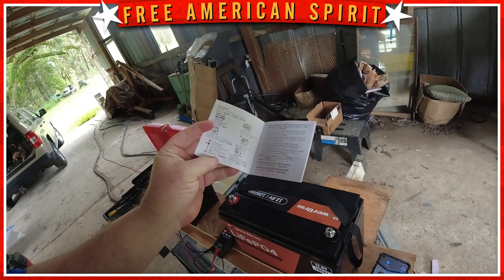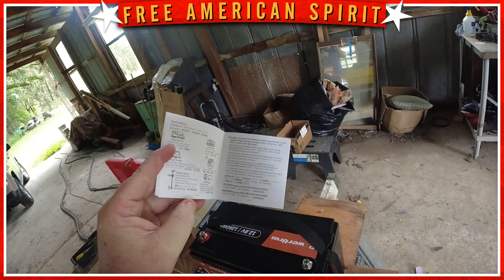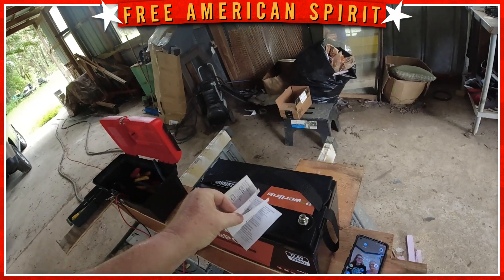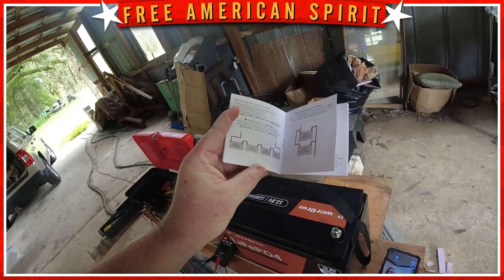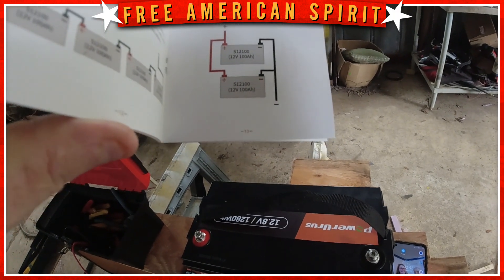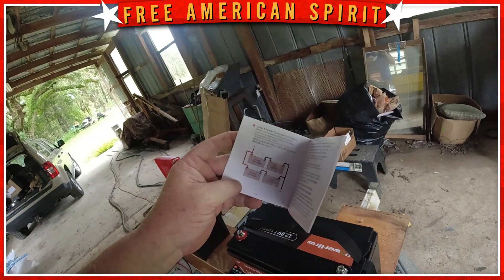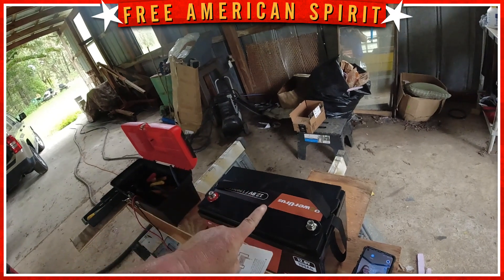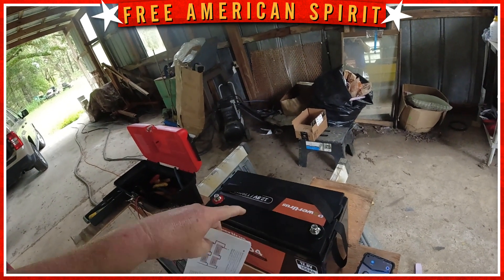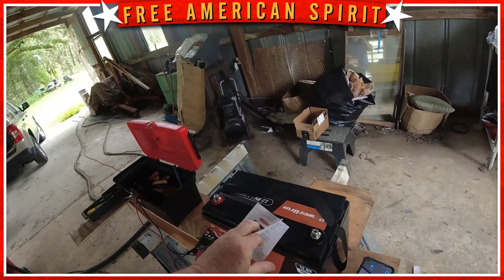Other items in the manual: for trolling motor use it shows all the things you can use this battery for. They suggest charging the battery to 12.8 to 13.24 volts to avoid over-discharge when storing. Then you've got the wiring diagram for putting them in series — you can go up to four batteries in series for 48 volts, or put them in parallel. By the way, on a boat you never want to ground to the boat itself, at least on an aluminum boat. You can also do series and parallel combinations: four 12 volt batteries in parallel, two sets of series parallel for 24 volts, three batteries for 36 volts, or four batteries for 48 volts.